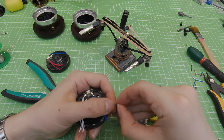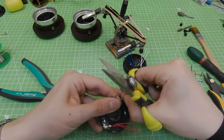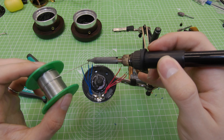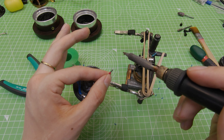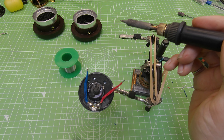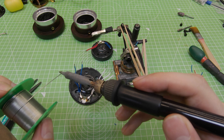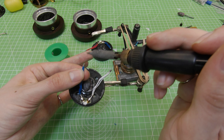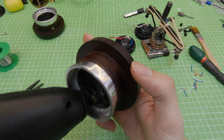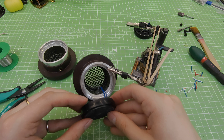Now that the cups are all ready, it's time to move on to the drivers. I'm just going to tin all six of these wires per driver. It's a bit of a faff, but that's how Grado does it, so that's how we do it too. I'm not quite sure why they use so many wires — lots of little wires instead of one big good wire — but just soldering them all together and conglomerating them into one single strand, so that we can solder it onto the driver. Then I'm just going to chuck a little bit of hot glue in there, and that's the final step to make sure that those things will never come out.